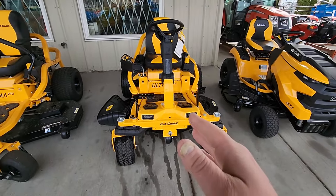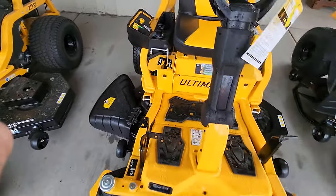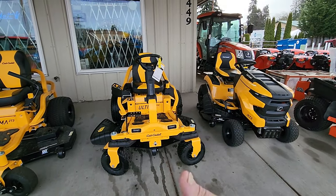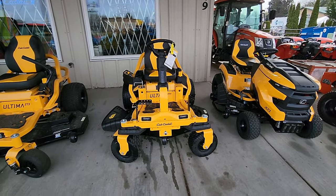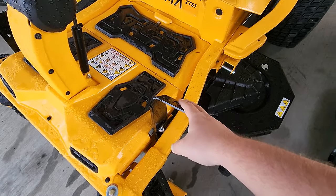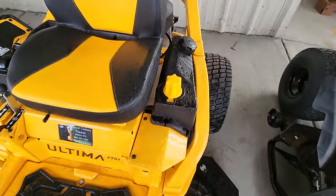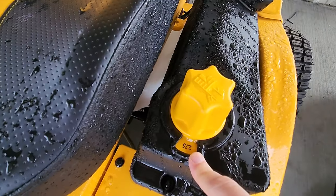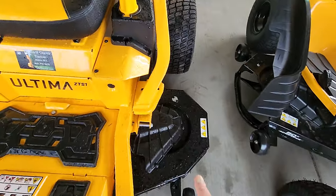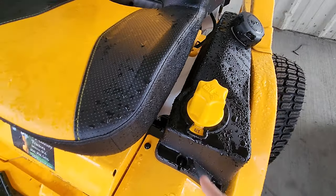The hill ability of a regular mower is there because the rear wheels are pushing and the front wheels steering. But you also get the advantage of being a zero-turn — these wheels will turn all the way to the side. Let me turn this steering wheel. This machine will do a complete about-face, which makes it way more efficient for mowing. Push this down, the deck moves up. Turn this knob and you can set your minimum deck height, so the deck can go up to drive over something, then drop back down to your mowing height. Really nice.